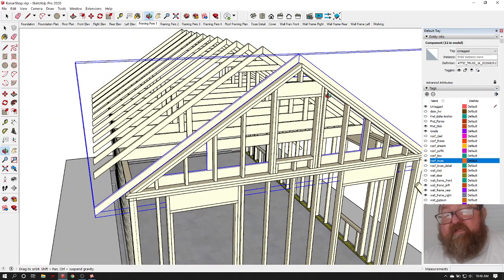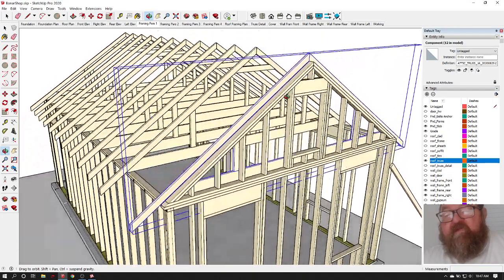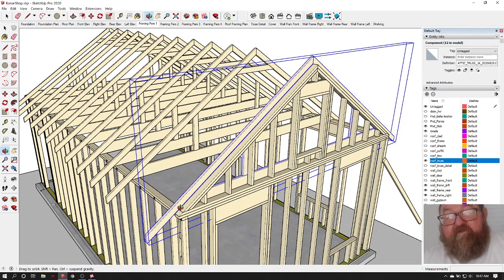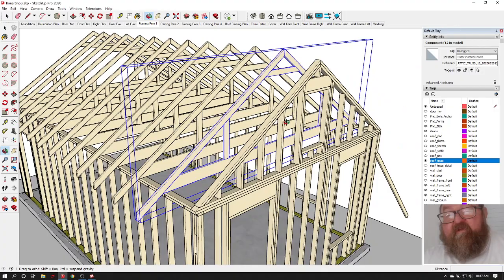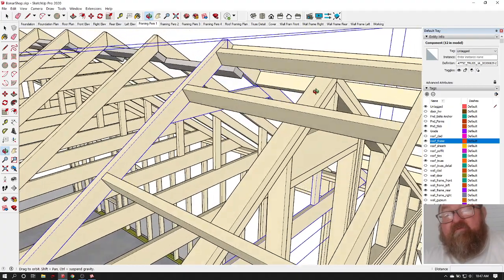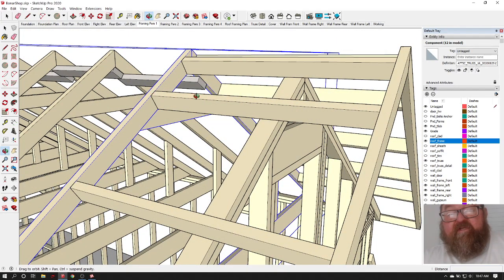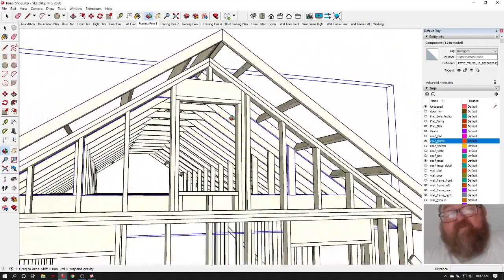But he wanted a window in the end of the wall. And so I think this is kind of an old school gable wall end framing. And I think it works great. You can decide, you can actually set your trusses first and then build this wall, so you can use a truss as a guide. You certainly do want to use the trusses as a guide, because if I move that back and I turn on the roof framing, you'll see this is why the dropped wall is there, so that you can put your outlooks, you nail them flush here and they hang out, and this makes your overhangs really strong. You will never have a droopy overhang if you do it this way.